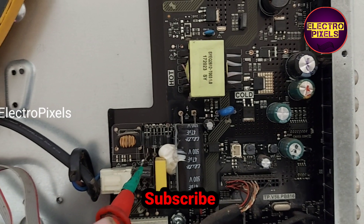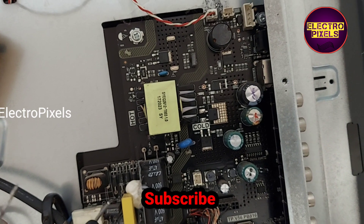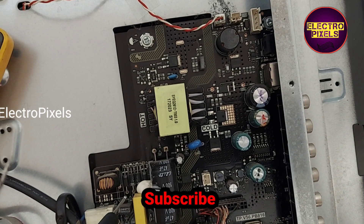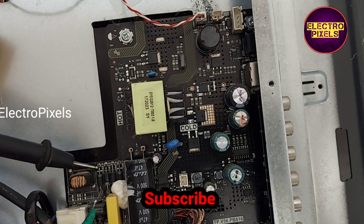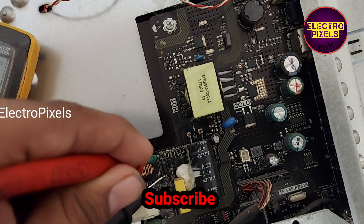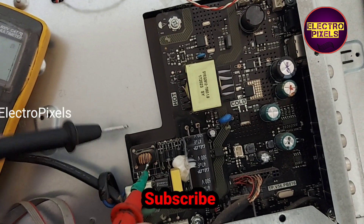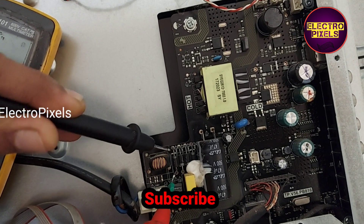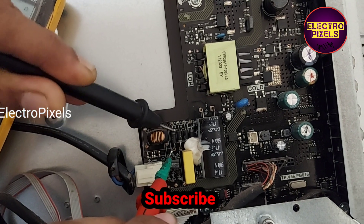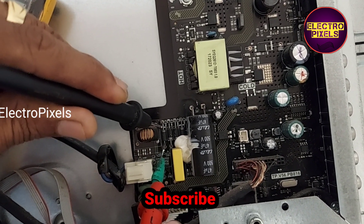This is the motherboard. While checking the motherboard, I found that the fuse and one of the diodes is showing shorting — you can see the beep sound in the multimeter. This diode is short, and also in the power supply section the fuse is open. So to repair this TV, we need to change this diode and the fuse.